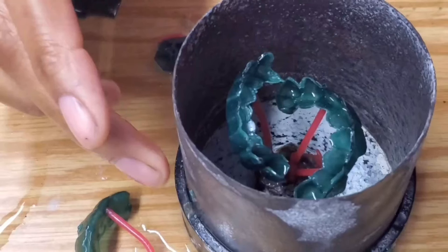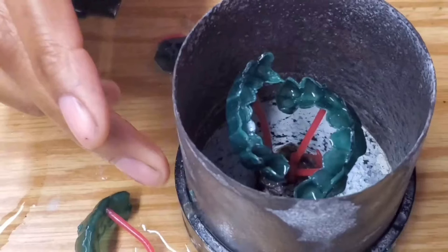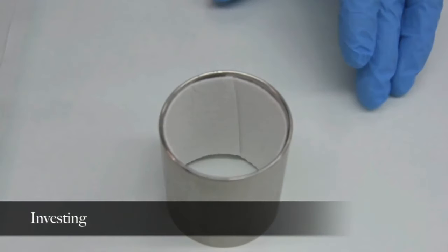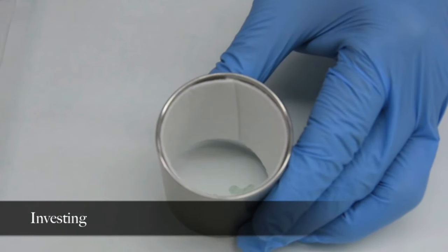Two more things I wanted to point out before we move on to the investing part. Right now, her piece looks kind of wet — she sprayed a debubblizer on the pieces when she adhered the wax sprues to the tree trunk, so that she doesn't have a lot of bubbles pop up when she casts it in metal. You can also get that link in the description. Another thing is using a cellulose liner or a ring liner for your casting flask — this basically stops your pieces from shrinking. It's like insulation for your piece. The overlapping line should be melted down with wax so that it has no gaps, though you can also just pour investment over it to hold it in place.